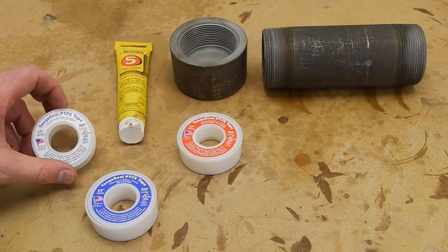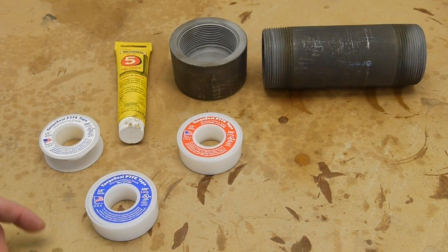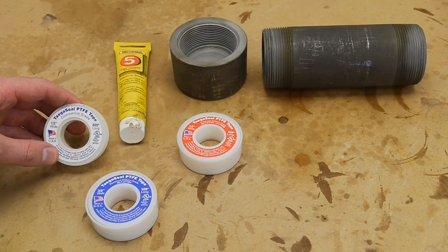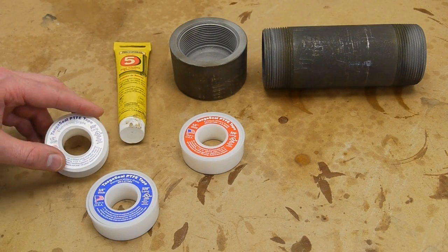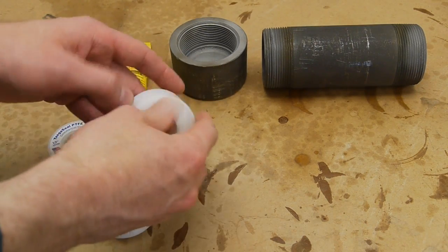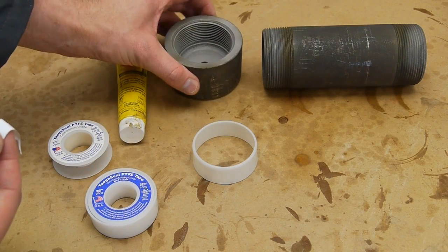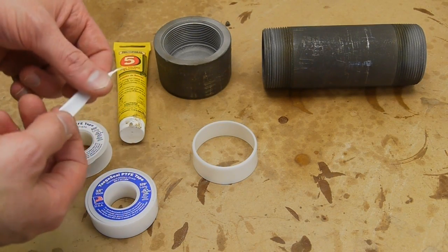You may have seen or used Teflon tape. A lot of people claim it isn't even designed for sealing pipe, but it does work pretty well. Be aware though: standard Teflon tape from a hardware store is a fairly cheap, low-density grade. McMaster sells it in commercial grade, standard military grade, and premium military grade — and this actually is worthwhile. The higher the grade, the higher the density. The premium military grade is thicker and much more dense, making it easier to handle and far better for large-diameter pipe sealing. You don't need as many turns and you get a better seal.